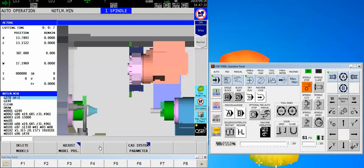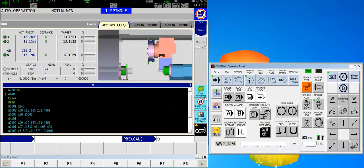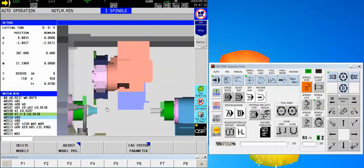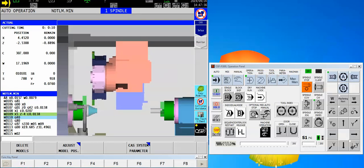So I'm going to run my program first just so that you can see what it is. It's fairly simple. Basically I just took a five inch chunk of steel and with the turning tool I'm cutting a taper all the way down to a one inch diameter.